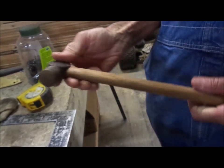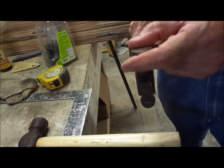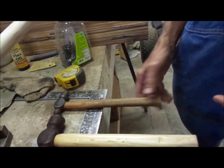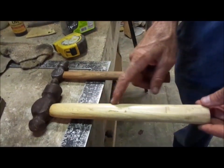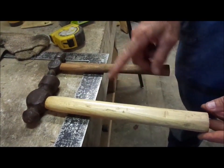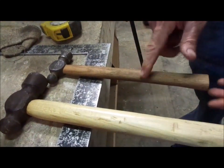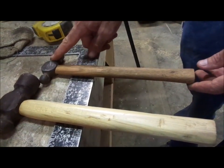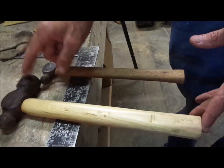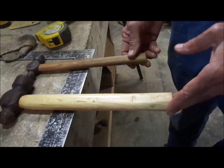This one here is a little hammer handle — y'all saw me put it on in the video, a little tiny one. This was Wanda's dad's old hammerhead that they were going to throw away and we brought it home. This one I found in the garbage. This is a hickory handle and this is a red oak handle — so you can see the differences between the two. For a small hammer, the oak was perfectly fine, but for the big hammer I decided to go with hickory because it's a lot harder and a lot stronger material.